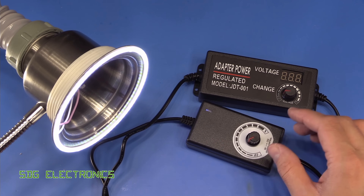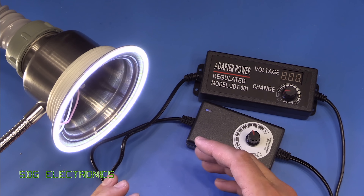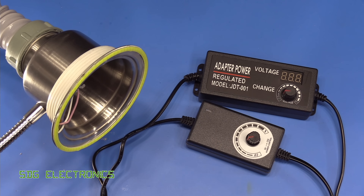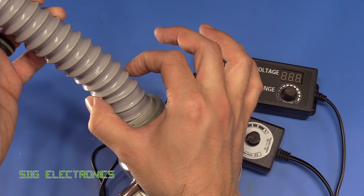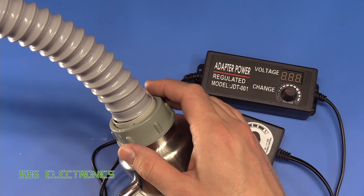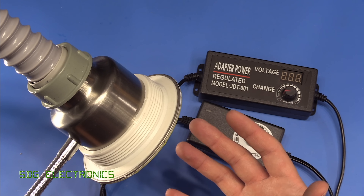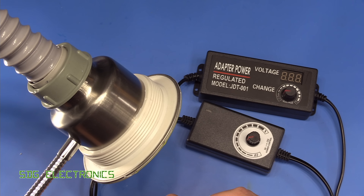This unit does have a ring light on the nozzle which is quite effective for soldering underneath - you wouldn't need any other lighting, and because it's in a ring you get fewer shadows. But generally speaking this whole system doesn't quite work. The airflow through it isn't quite enough, partly down to this quite restrictive tubing which is only about 25 millimeters in diameter. If you used vacuum cleaner tubing at typically 35 or 40 millimeters, you'd get better airflow and it would be a bit more effective. You could also find a fan with higher pressure - this one doesn't seem to have a great deal of pressure, as you could hear when you put the lid on. If you could find a centrifugal fan with a bit more pressure behind it, you might be able to get more airflow up the nozzle.